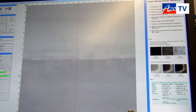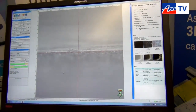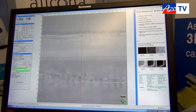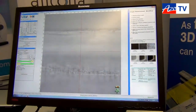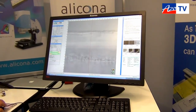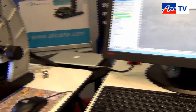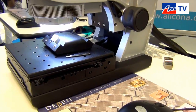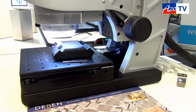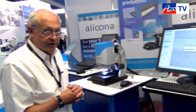In operation we bring the head up to its highest position and choose that as the upper Z position. We scan down through the object to the position we wish to finish and click the second button. We've now defined the focal range over which we'll collect data. Once we've defined the vertical resolution, we press start measurement. The head slowly moves over the surface, the ring light illuminates it, and we capture data while measuring the sharpness, which gives us a very good measure of the repeatability and robustness of the data being produced.